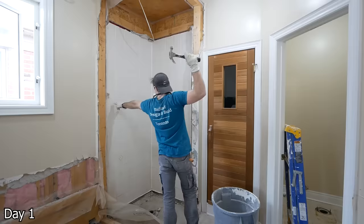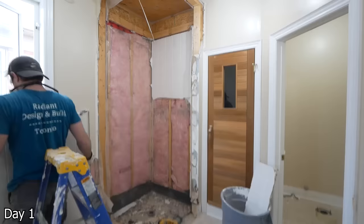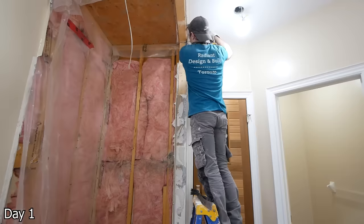When it comes to removing tiled walls, I like to take my hammer and just make a nice little horizontal line and then rock the sheet back and forth until it comes out. When you can remove them in big sheets, it's just so much easier — because when you break them down into little pieces and it creates little rubble, it's just messy, it's dusty, and it's a pain to get out.